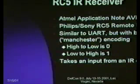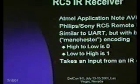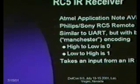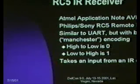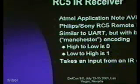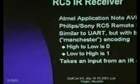And then I talked briefly about doing an IR receiver if you want to be able to build a remote control, a wireless remote control application. The Philips Sony RC5 protocol is explained in AVR 410. It's similar to a soft UART, except it uses biphase or Manchester encoding, where there's a transition on every bit time. A high to low transition with the transition in the middle of the bit is a zero. A low to high is a one.